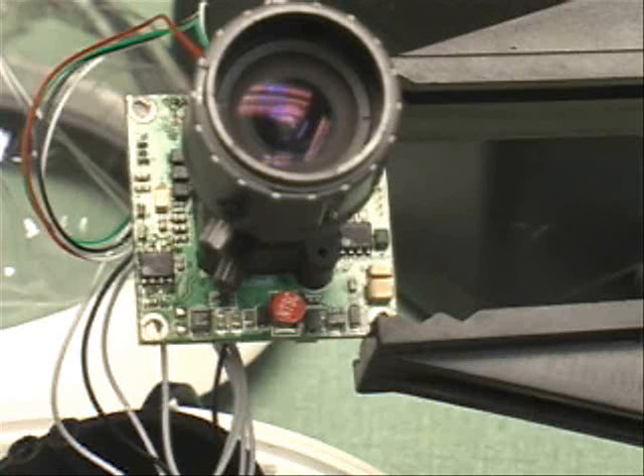As a footnote, the capacitor has been tested in and out of circuit with my reliable capacitance tester, and both the DCR and the ESR test good on it — so there's nothing wrong with the capacitor. Something inherent in this circuit, possibly the LSI chip on the other side of this board, has changed, which no longer requires that capacitor to be installed. The camera has been on for well over 12 hours and the problem has not re-exhibited itself. In the next couple of weeks or months I'm going to be installing that dome camera outside the house. If the problem re-exhibits itself I will post another video; if not, then that's that. Thanks for watching.